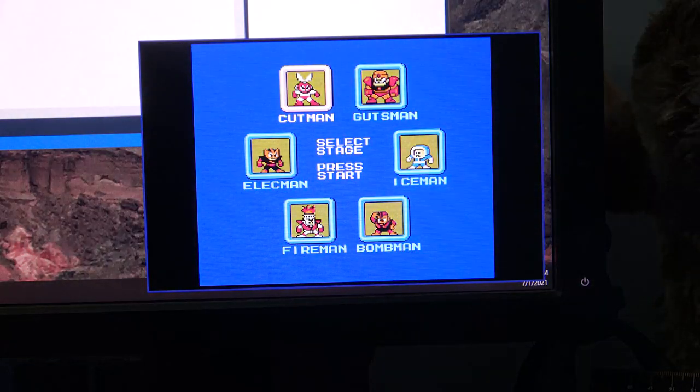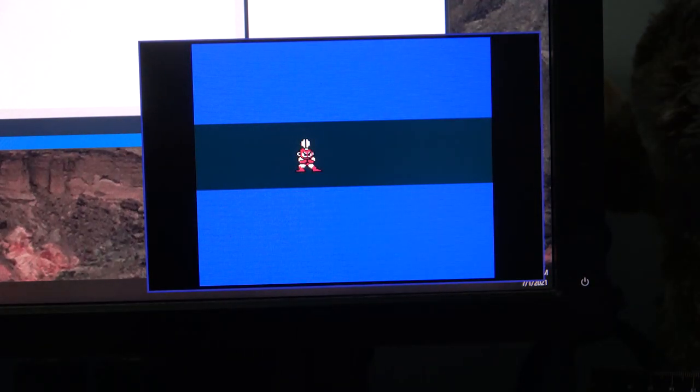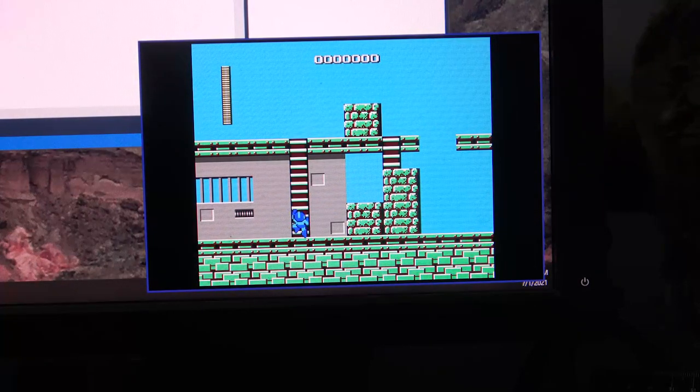Although this should work with two-player games now as well. Because remember, it's only going to send out 8 bits. So even if the Nintendo continues to ask for bits, I'm not going to sample the controllers until I see the latch again. But seriously, you are really annoying.